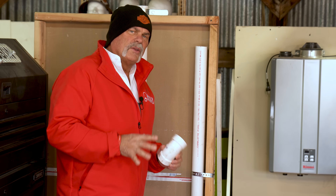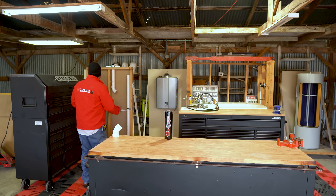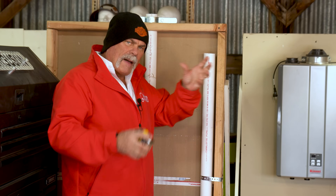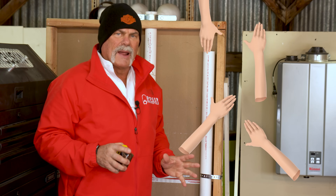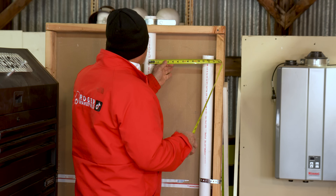What we're going to do is something a little bit different. Set the fittings back down over here. This is the way you want to do this if you're taking your plumbing exam. If you want to learn to work smarter, not harder — stove piping it like that, holding it up, you need four arms: two to hold it, one to pull the tape measure, and another one to write it down. An easier way is to figure your center to center.